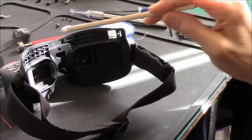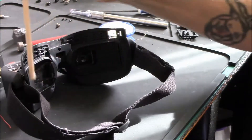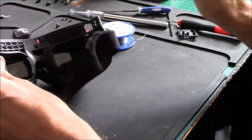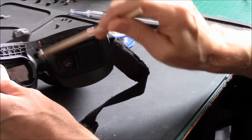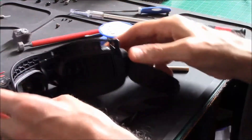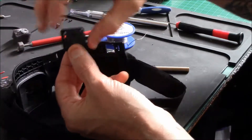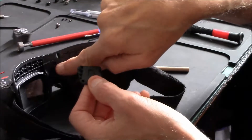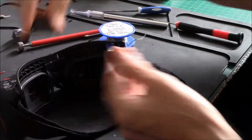As you can see, I've took the foam back off and I've took that sticky double-sided stuff that you stick the foam on. The wires run through here and to the fan here. There's one screw - undo the one screw. The actual fan plate is on top; there's four little screws on there. You lift that off.